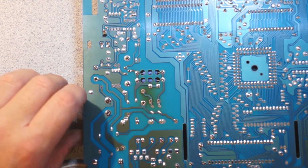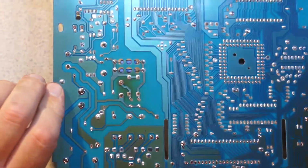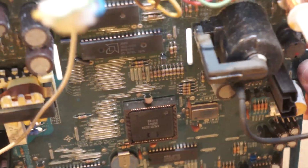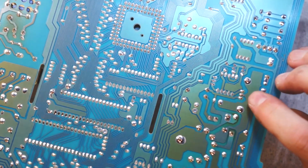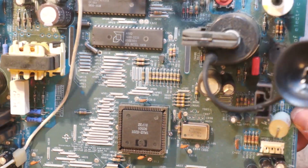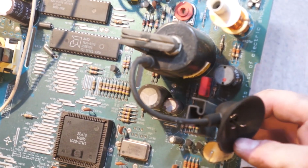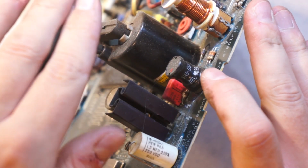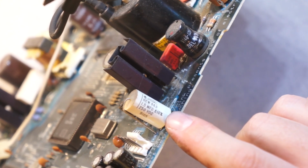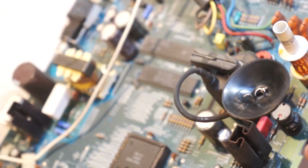You can see that device right there, which is the 2 rectifiers on that end of that transformer, have gotten pretty toasty, as well as some parts over here because of the discoloration. So this is the power device for presumably the high voltage. So you've got a big chunky inductor, this big TO220 device. That's like a 1.5 microfarad film capacitor. That's pretty big and chunky, and it's mounted up on end too, which is kind of interesting.